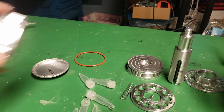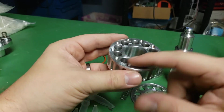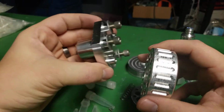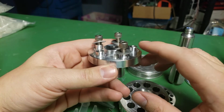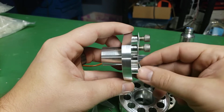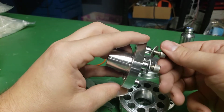On this part, I forgot to mention, it's 2 ops on this, on a milling machine. I held it and I did the top, and then I flipped it and I faced it off, but there's these rotary grooves. So I made a little fixture. It's basically just got matching pegs that stick out that are threaded. And what you can do is you can take these off.